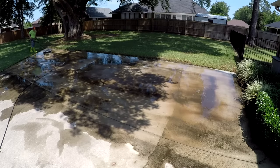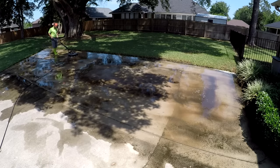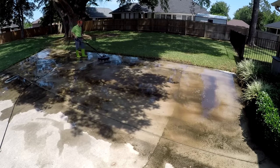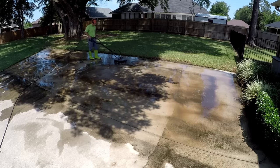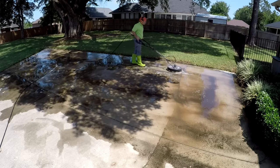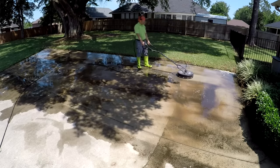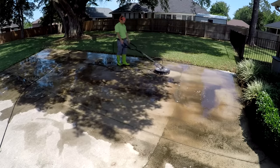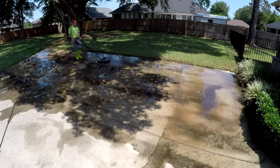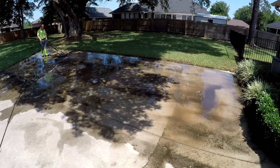You don't have to worry too much about the order. The very last sections I did, all I did was pressure wash everything twice with a surface cleaner, make sure it got two quick passes, then put some bleach down, let it sit, and then rinsed it off. It looked just as good as the stuff I spent three or four times as long on. The reason you'd even want to use bleach is because it's going to hide streaks and clean everything up. If I did not use bleach when using the surface cleaner, it's not going to leave a good finish. And if you ask why not just use the wand — the wand is going to destroy your hands and arms. You're going to get Raynaud's syndrome, which is like vibration-induced nerve damage.